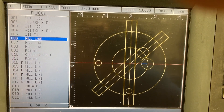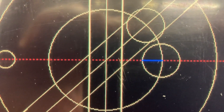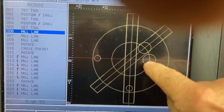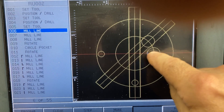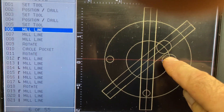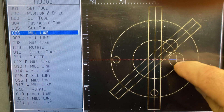Now the first real operation — we're cutting everything with a four-flute solid carbide end mill. Instead of plunging the end mill straight in because there's a lot of solid material, I plunge it off to the side and walk into it to the center, a little past the centerline. I do that three times at different Z-depths until I get to the final depth. The part is 0.625 thick, so when I get to 0.635 deep, it's all roughed out. Then I can plunge straight in on center and do a circle pocket — rough all that material out, finish pass, and that's done.